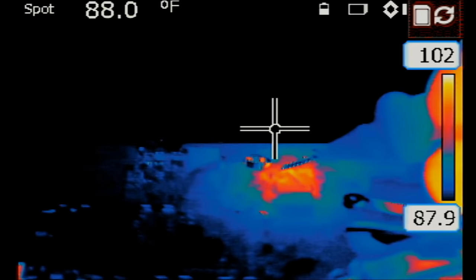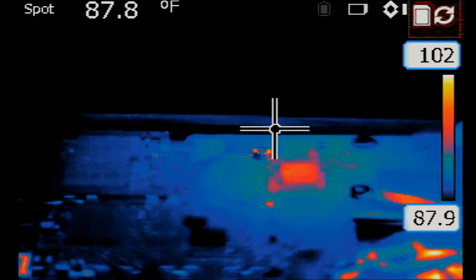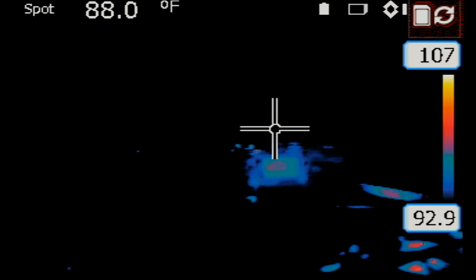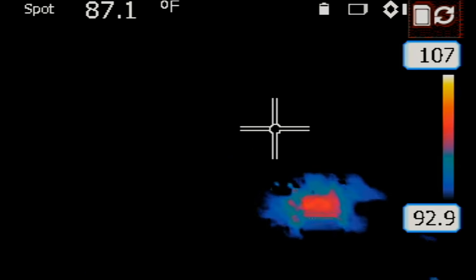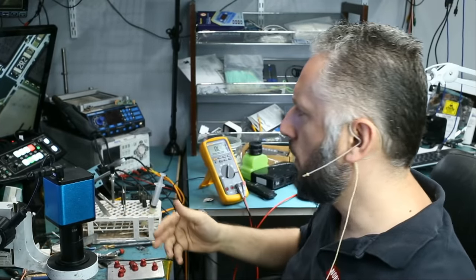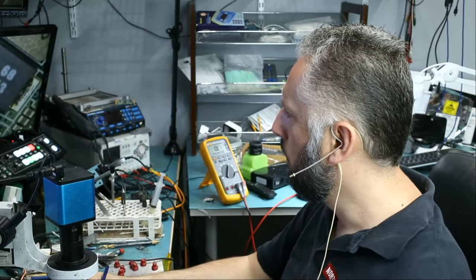This is the inductor — the coil. Let me increase the temperature boundaries a bit more. Inject 1.2 volts and see what happens. This whole area is getting hot. I think what I'm going to do is remove that coil just to see if the short is coming from the MOSFETs or from the lower part of the board.